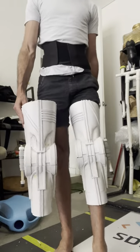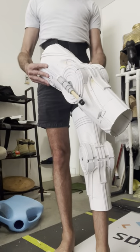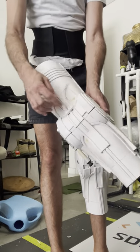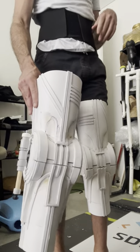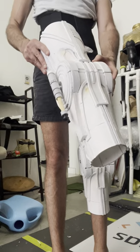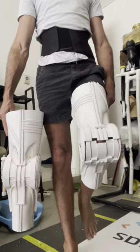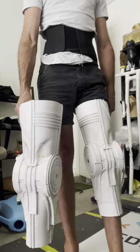Overall they're basically done. I've got to paint them silver, do some sanding and finishing, get some of these little gaps filled in — I'm just going to use 3D printer resin and talcum powder as a filler. Within a day or two I can have these basically painted and finished off.